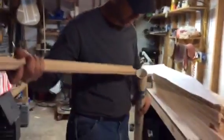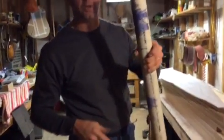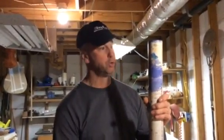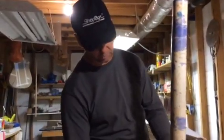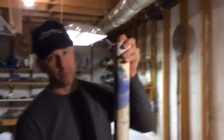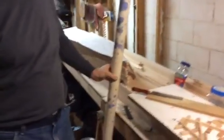These are the cap strips that we're using, and by necessity they have to be bent in order to conform to the shape of the wing rib. The way we elected to do that was to simply get a two-inch piece of PVC tubing. We glued one end and left the cap on the other end. We can do enough cap strip for probably four ribs at a time. We stuff it full, go upstairs to the oven and teapot, boil a couple pots of water, get it good and hot boiling, and fill up the tube to an appropriate level — just the area of the cap strip that needs to be bent. We fill that up with boiling water, put the cap on it, and set it aside for 24 hours. That has been working out really well.